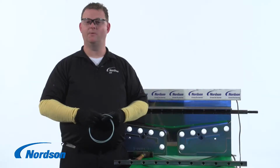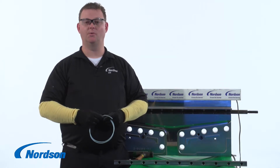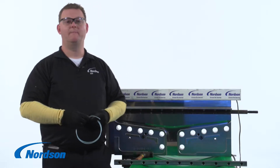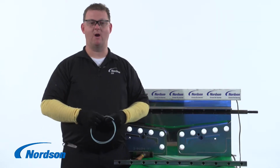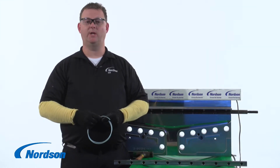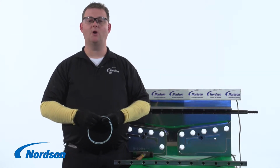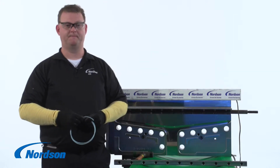The rounded seal groove restrictor bar is pushed out the same way as a square sealed grooved restrictor bar, but there is a difference installing the rounded seal groove restrictor bar. The main difference with this type of restrictor bar is that the seals are installed into the bar before it is put into the die. You will start with seals cut 4 inches longer than the R-bar itself.